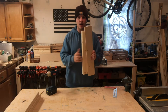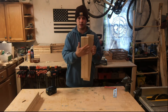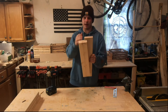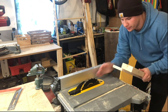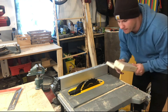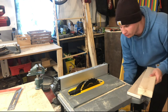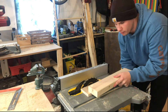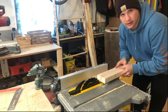Now that I've got those two pieces screwed together — as you can see it's screwed in at an angle — we're going to take it over to the table saw and get it cut. Set the table saw rip fence to the same width away from the blade as the bottom scrap board so it can just slide right in there. Make sure your blade is up past the 2x4 because that is what we're cutting through. Once you've got all that done, go ahead and cut.